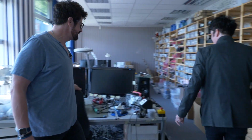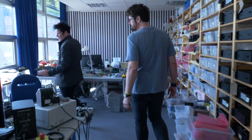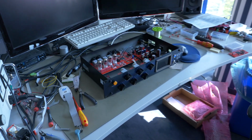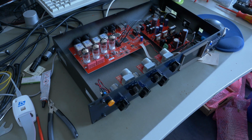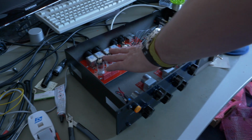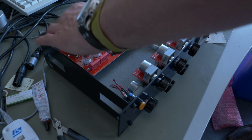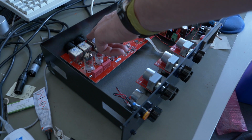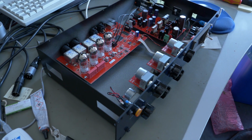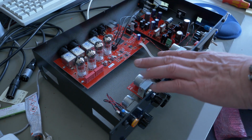So at the moment you've got all these different things being built. What's going on in this station here? What are they doing here? We developed some digital stuff. That's the reverb unit. As you can see, can I come closer? That's the main board. You see the tubes and the transformers. That's the analog path, input transformers, input tubes, output transformers. And in between there are the converters and the chip that is calculating the algorithmic reverb. And also you can see the motorized pots here.